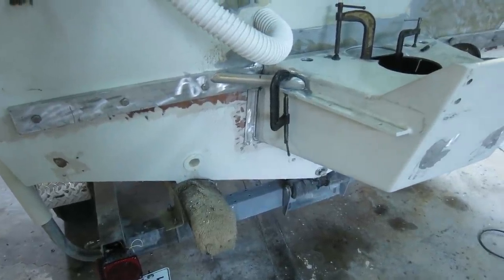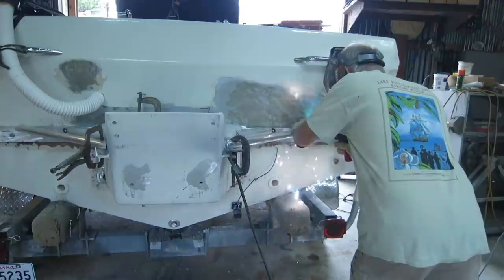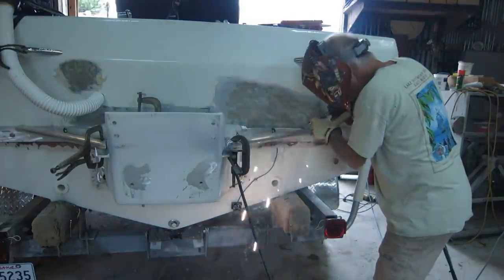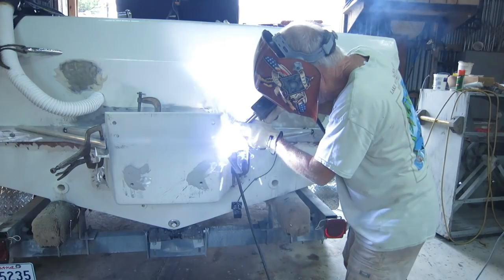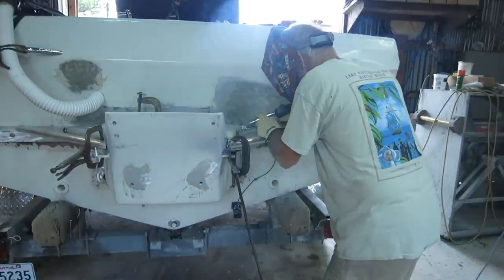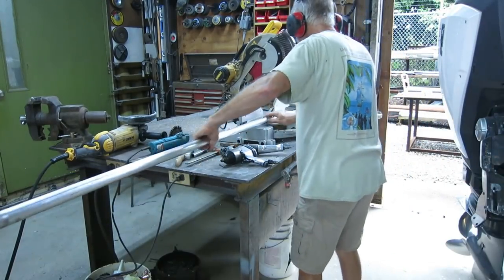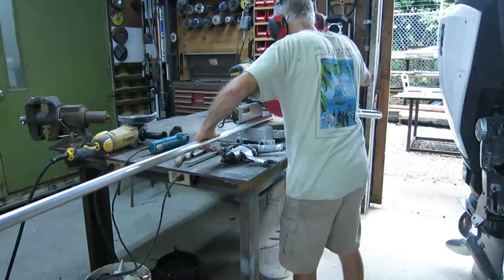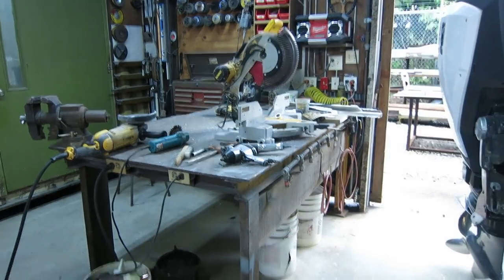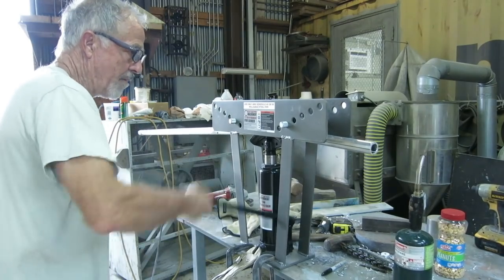I'm comfortable now — my gremlins and I are at peace with this whole situation. The first two diagonals on each side are the ones I think will help support the pod — they run back to the plate right next to a half-inch through bolt. The other aluminum pipe is just to hold up the swim step — I don't think it'll add more strength to the engine pod itself. I used pretty much two full ten-foot sticks of this one-inch aluminum, which is just two and a half pounds per stick.